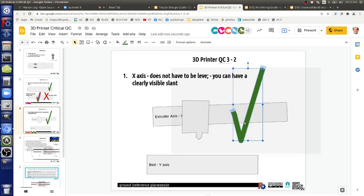It's quite interesting when you look at it in action printing. You can see the z-axis doesn't just move up step by step. It doesn't move up a step, print, and then go to the next layer. It's constantly moving up and down. The z-axis constantly corrects for the bed not being parallel to the ground. You'll visibly see it moving up and down very gently to follow the contour. Say you've got a concave surface, I think it follows that too. So it doesn't have to be just slanted. It could also be concave or convex, and it'll still work.